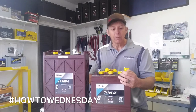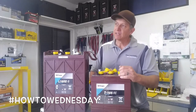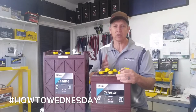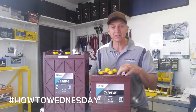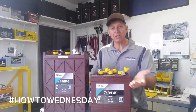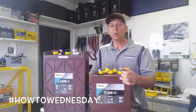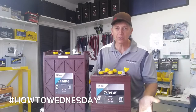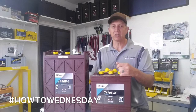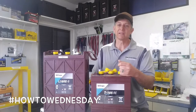Now let's talk about age. How old does a battery bank have to be before that rule takes effect? About a year to a year and a half is the cutoff. So if I have a battery bank and a cell dropped out — it could happen if baking soda gets into the cell, which can really damage it — and the bank is a year to year and a half old, you could probably put a new battery in there; it's going to be okay. But two years or older, definitely not. Your battery bank is unbalanced and you're going to have problems. Your new battery investment will be short-lived and you'll be replacing the whole battery bank anyway.